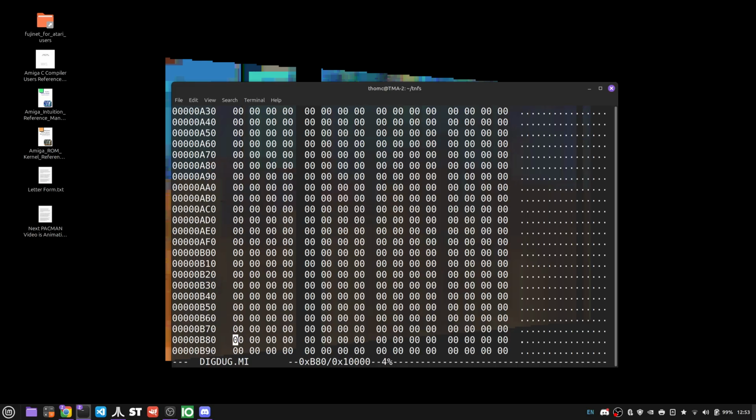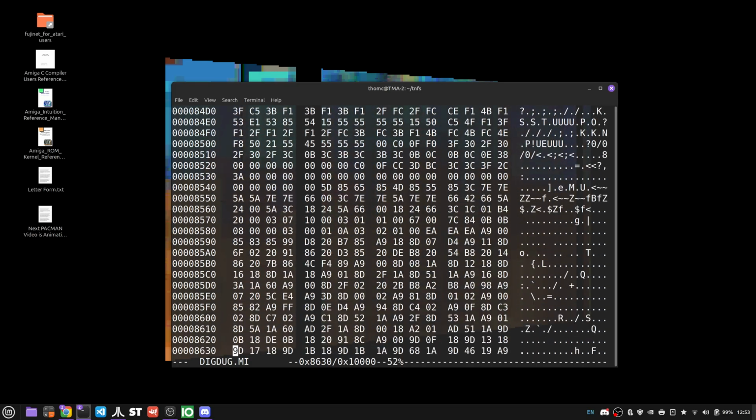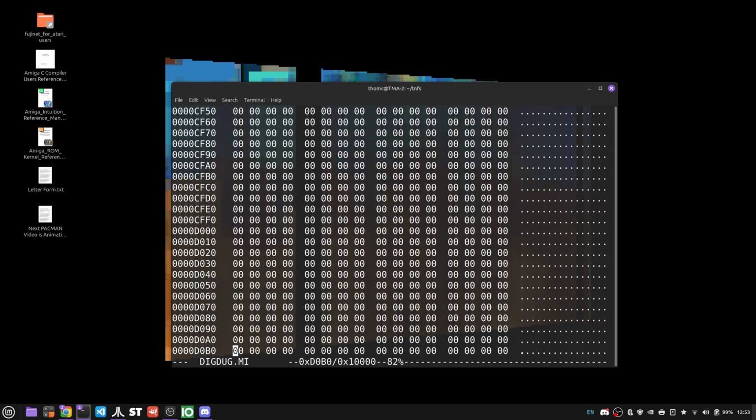That's fine. So we scoot all the way down until we hit 8000, at which point there's our cartridge. Our cartridge now starts, and all the little bits of binary data load all the way in until we hit BFFF, the end of the cartridge. And you'll see the EA for the end ROM error that happened right there. There's one of these at the start of the ROM, and there's one of these at the end of the ROM here. So I guess he's using it as a marker. But you can see the cartridge header here with the start address, the cartridge type, and initialization addresses. Good to go. This looks like a sane cartridge.